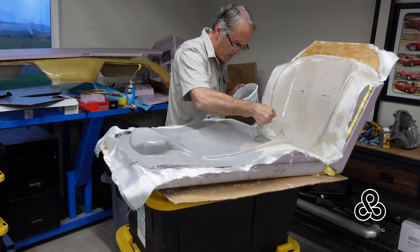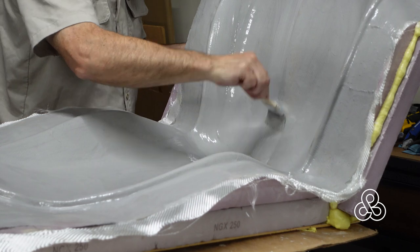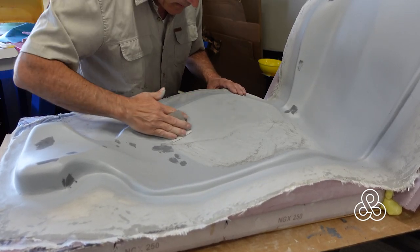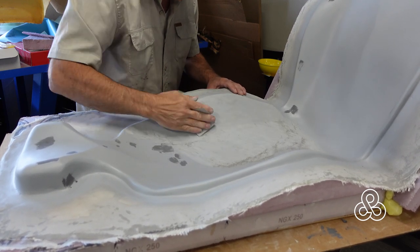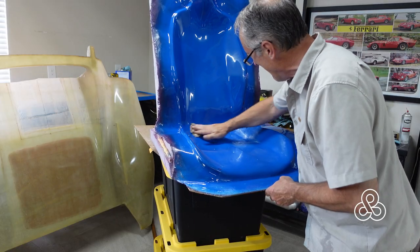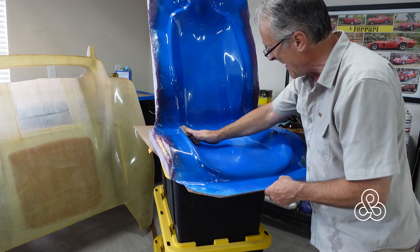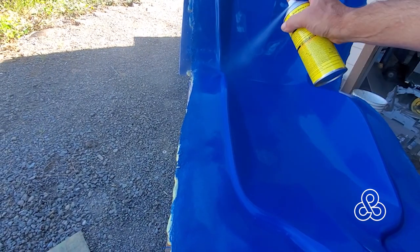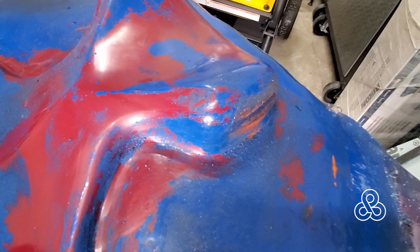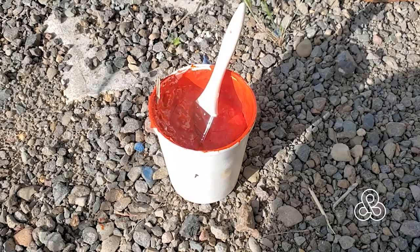Now, typically this plug that we're creating to make these seats is pretty simple — we only need it to create one mold. So after I got the slurry on and sanded down nice, all I need to do is put a coat of paint on it. Being such a simple plug, I thought I would just use rattle can paint. I put a coat of red on there and found it was kind of wrinkling up a little bit, so I sanded that down and put a nice coat of blue on. Everything seemed good and ready to go. But when I went to start the mold, I decided to use a spray release agent instead of my typical method of waxing and PVA. I don't know if it was the release agent or more likely just the paint, but when I started to put a polyester gel coat on, it had a terrible reaction and just started blistering everything up. I had to abandon the gel coat — when you leave it all in a cup, this is what happens: it starts generating a lot of heat.